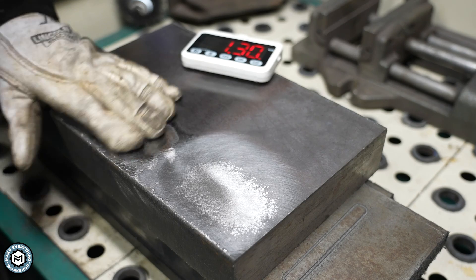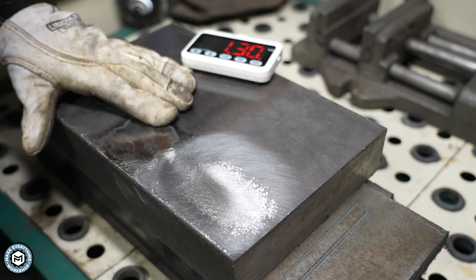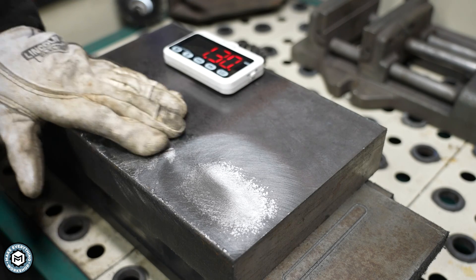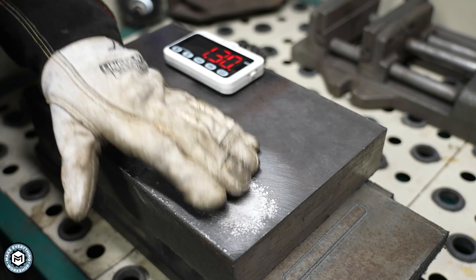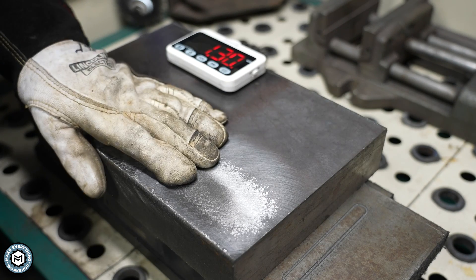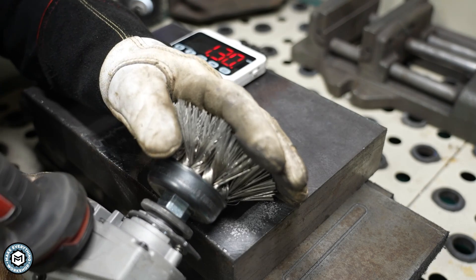The Victo Grain did a great job but it left heavy grinding marks. Heavy plate like this has very thick mill scale — I can actually feel the bump as I go from bare metal up to mill scale, probably a couple thousandths thick. To be able to achieve that so quickly and also not take away any metal is really valuable.